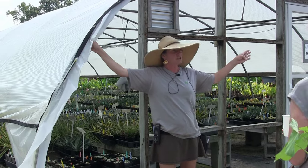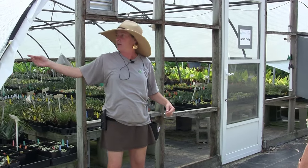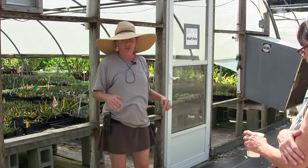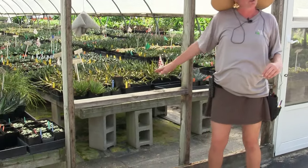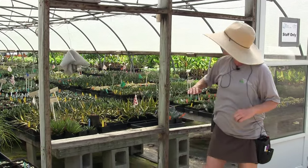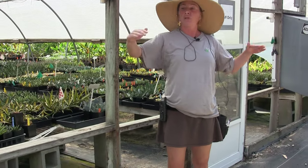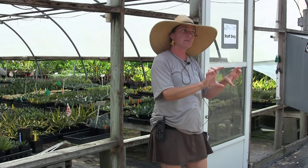First think about your ground. We've got direction, now we've got your ground, and we're thinking about what kind of weather we're going to have — that will change what you buy. Then you want to look at the flooring. A lot of greenhouses prefer gravel rather than ground cloth. No matter what you choose, each with very different benefits and drawbacks, the entire floor of the greenhouse should be level. If you're on a hill, that can be a problem. You should have at least five inches of gravel all the way across the bottom, and depending on how you're watering, you want to have an outward trench.